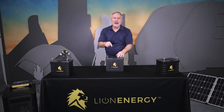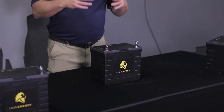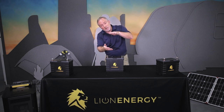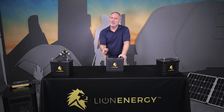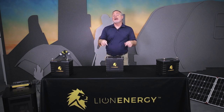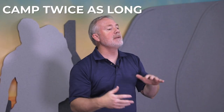Another great thing about this battery is it has twice the camping time that a regular lead acid battery would have. This battery operates on a complete, or 100%, depth of discharge — you can use its full capacity all the way and then back it up. A lead acid battery is limited to about 50%, and once it drops below that you're out of luck. Because this one does a complete depth of discharge, you can use the full amp-hour capacity versus only half of a lead acid, meaning you can camp twice as long.